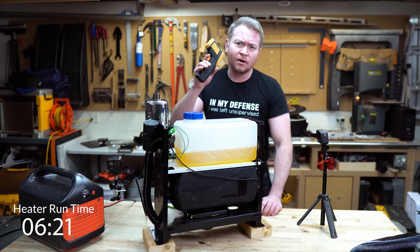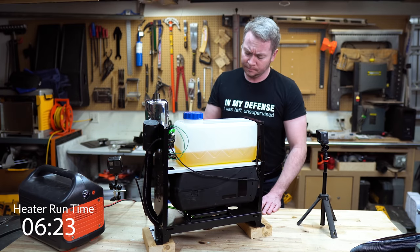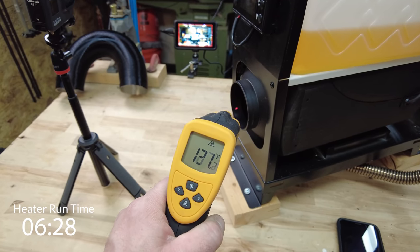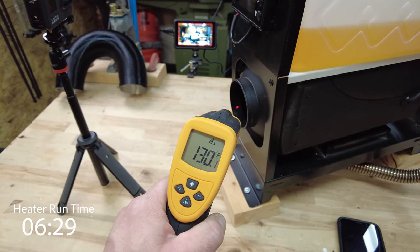The instructions that came with this thing are translated from Chinese and they're absolutely deplorable — almost impossible to decipher — so I went on YouTube and watched a couple of videos on how to use this panel. From what I can tell, as it starts to heat up you get the little red bars, which means it's running in its steady state. I'm unwisely running this inside an enclosed garage, but this is burning extremely clean — it doesn't really stink in here like burning diesel. Let's do a quick temperature reading to see how hot the air coming out is.